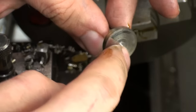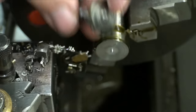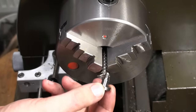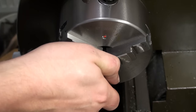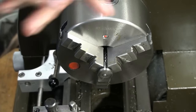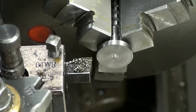And of course the surface from the parting tool is not very good, so we have to face it anyway to thickness on this side. Okay, let's do the back side of this shoulder bolt. For this operation we don't have to indicate the part in or something like that, because it's a non-functional surface. But as we're clamping on a functional surface, we don't crank down on this chuck like crazy. Okay, we take a light facing cut, measure it, and do an adjustment for the final thickness of this head.